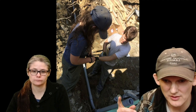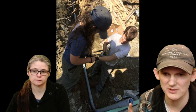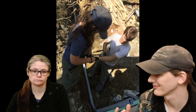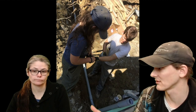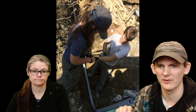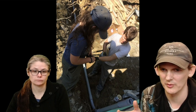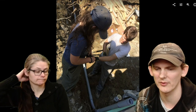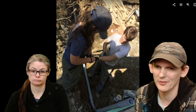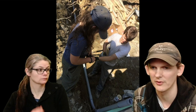And here at the end is something I know not everyone uses, but I think it's crazy. This is a frost extender. It's like a telescopic sleeve. Because this thing is built on top of the ground, it could heave, and you don't want to be breaking off your cables, but also you don't want to be breaking your pipe. So this thing expands and shrinks a little bit. And you definitely want to put a little bit of give in your wire too. It might move up by fractions of an inch, but it hasn't appreciably moved at all.